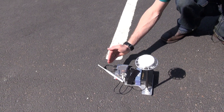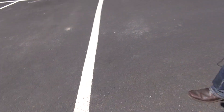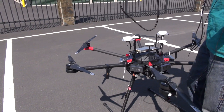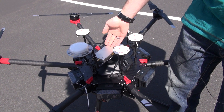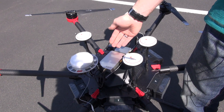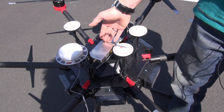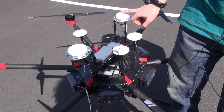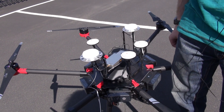We've turned this on and we've got a green LED, so we move over to the copter next. Same sort of scenario on the copter — you've got the complementary RTK that's bound. The LEDs vary a little bit between the ground and air unit, but the principle remains. We're going to wait until this turns to a solid green LED as well. That tells us that the GPS units have a lock and that it has been communicating with the ground station and is ready to go.